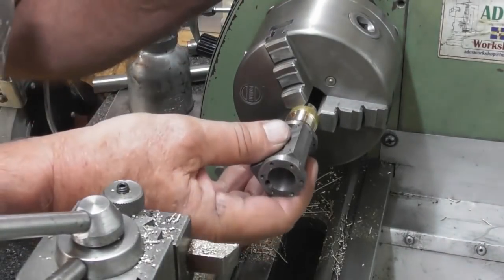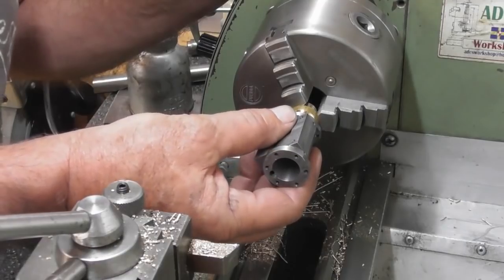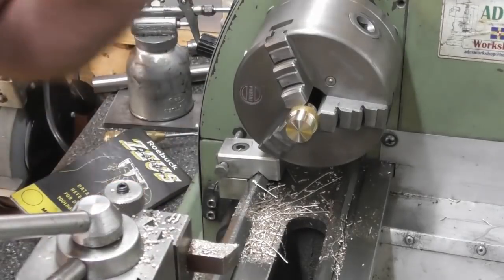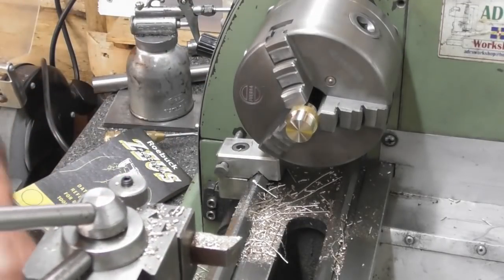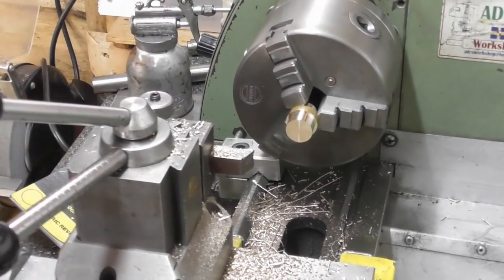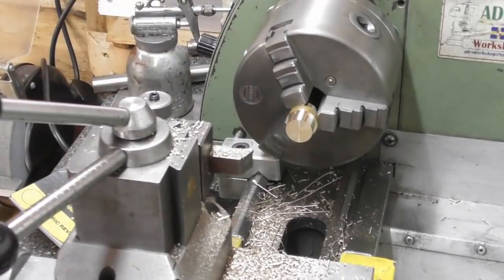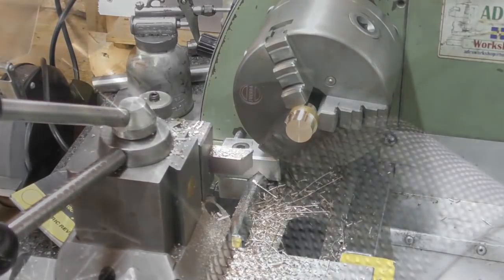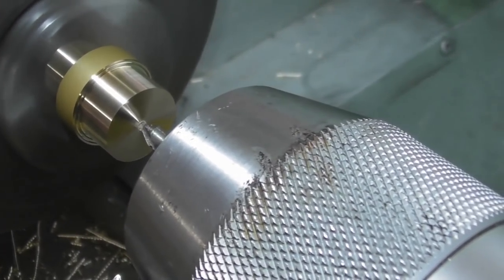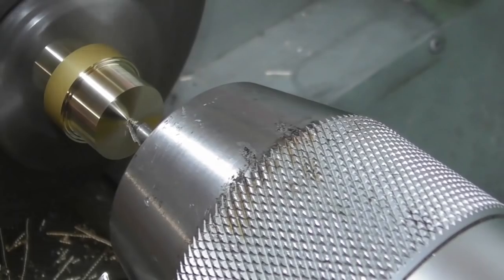Quick idiot check. And the cylinder doesn't fit. Okay. Good news. Right. So next step, I think, is going to be to drill and tap it 5BA. Is it 5BA? Quick look at the drawing. It's 5BA. The number 37 drill.